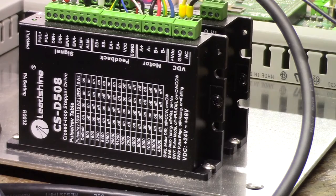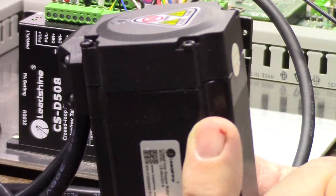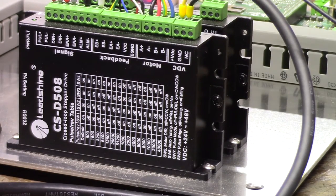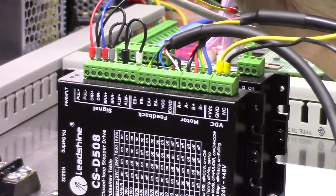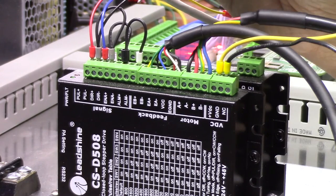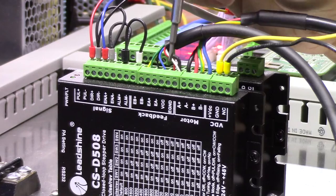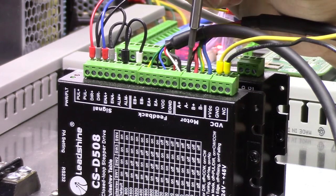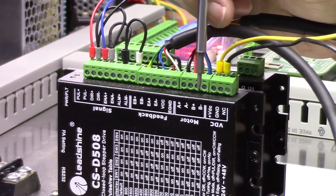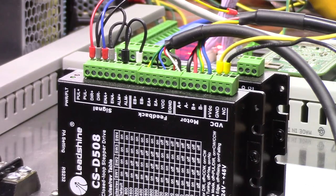The motor has an encoder — this is what you call a hybrid stepper motor. I had done one of these previously and had a snapshot of how the encoder cable gets connected. I bought these as a set from CNC for PC — the motor and the drives. For the encoder wiring: yellow is EB Plus, green is EB Minus, black is EA Plus, blue is EA Minus, red is VCC, and white with the shield goes to E-Ground. For the motor: A Plus is black, A Minus is red, B Plus is yellow with green tracer, and B Minus is blue.